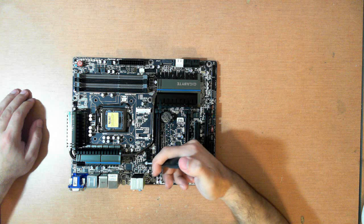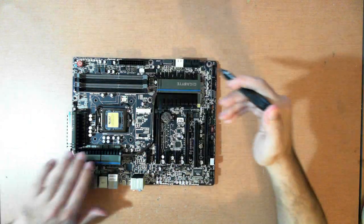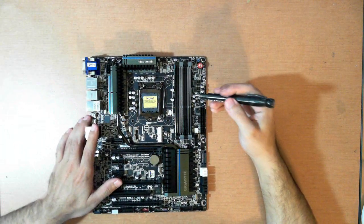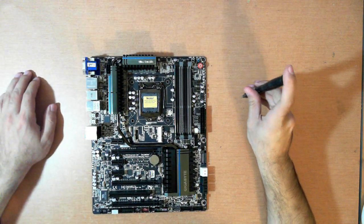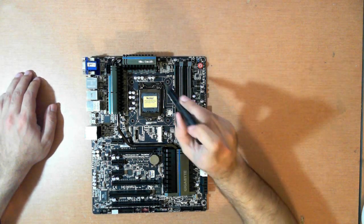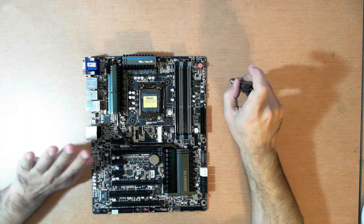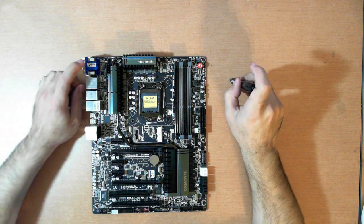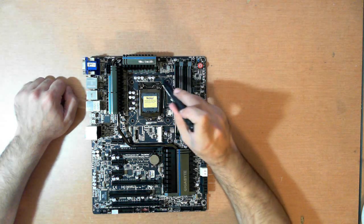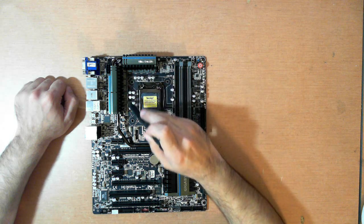Thunderbolt has tons of onboard components, has its own voltage regulator module here. And now let's move on to the whole digital signaling process of this motherboard, right? Now this motherboard uses 3 digital PWMs to give out your voltage rails, right? Here's the deal. Every modern voltage regulator on a Z77 motherboard, if it wants to support video outputs, needs at least 3 separate voltage rails for this VRM right here.